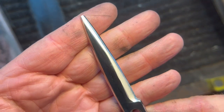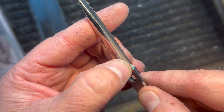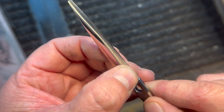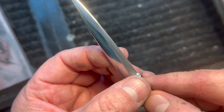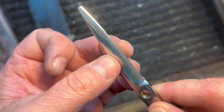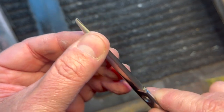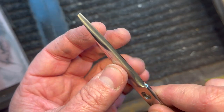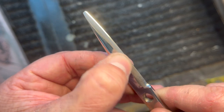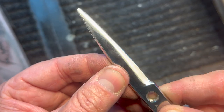I've stopped for a moment and you can see how I've started rounding that front surface down. I've actually gotten to the edge here on the shear — this area was gouged by the previous sharpener, so I may not correct all the way back to the early entry since that would just remove more metal than necessary. I'm staying just ever so slightly proud of the edge, and when I switch to the 60 and 30, I'll bring it the rest of the way in, since the burr off the 80-grit pad is quite coarse. I'll draw the backside of this angle up the face a little more to help with the blend when I reconvex.